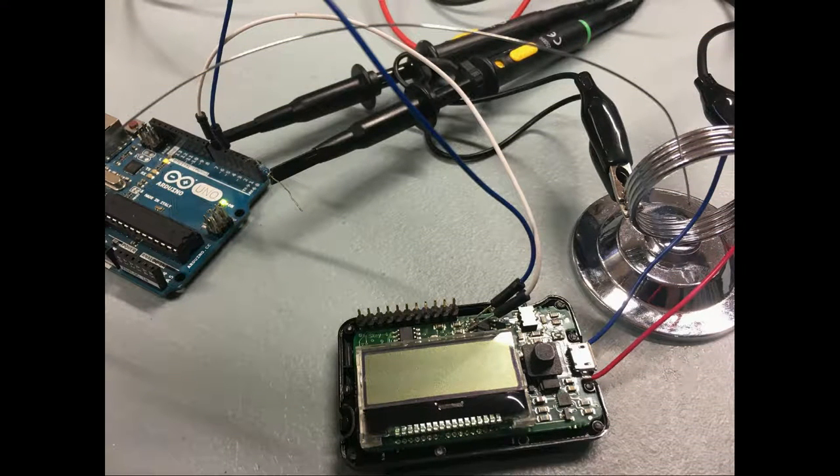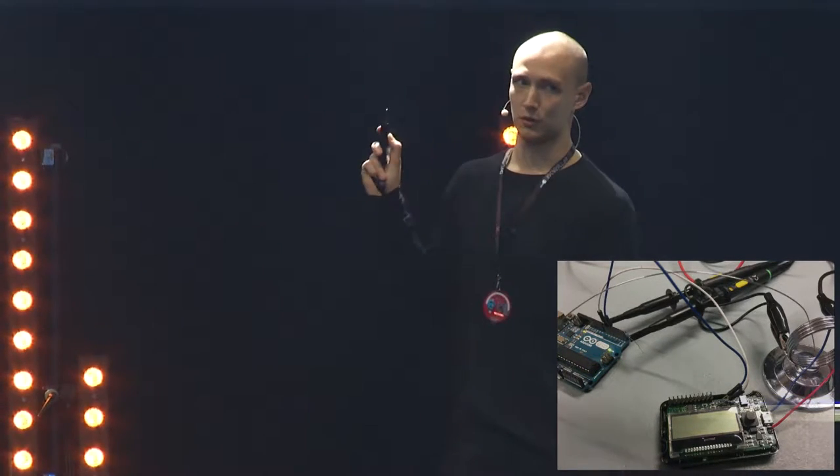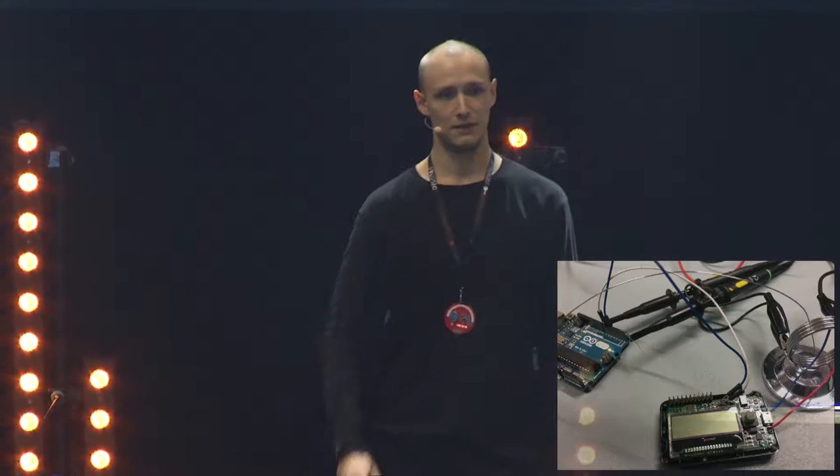Here's a setup from a couple months ago at Technohack in Tallinn, where I was first putting an oscilloscope on this device and trying to read it with an Arduino. It didn't work very well because I was just bit-banging it and it didn't really work. But this shows where we are — we're at the two-wire interface bus, sniffing it and looking at what information we can gain.